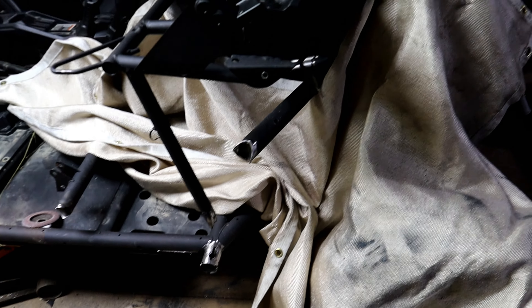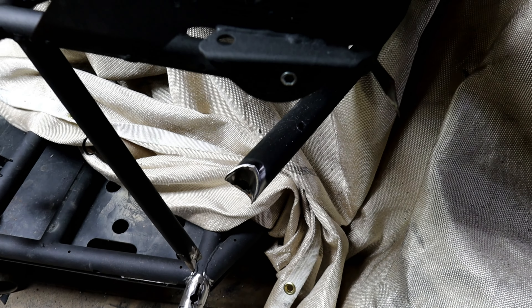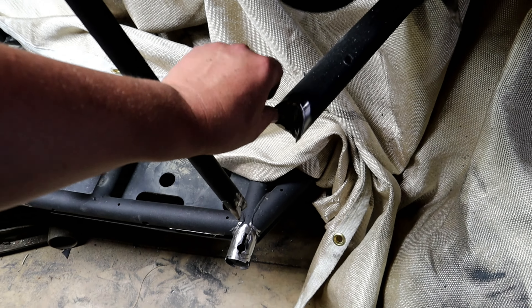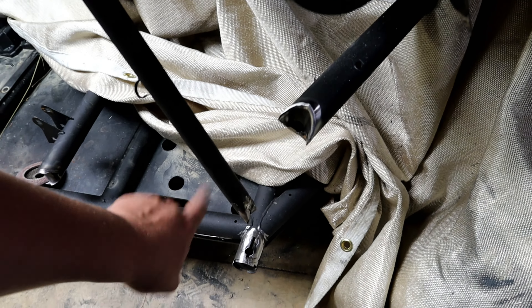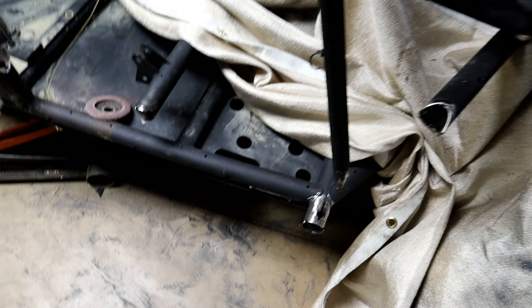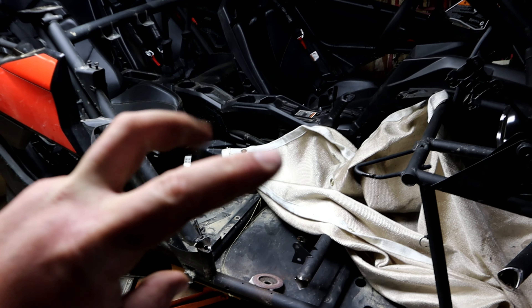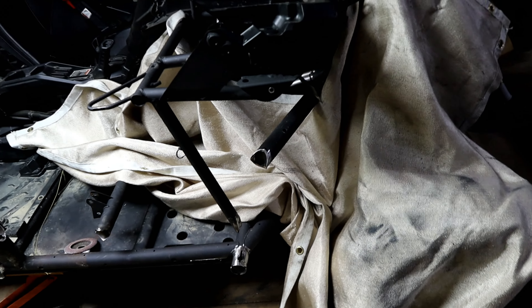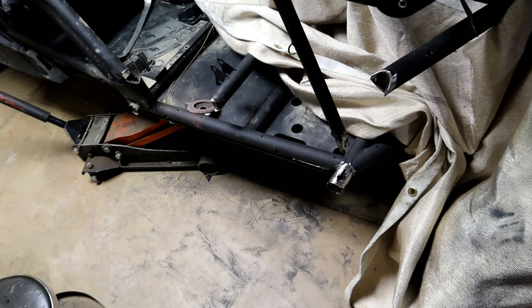As you can see, we got that bar out. We got everything cleaned up and are pretty much ready to throw the new bar in. We even got it all cleaned up in there, everything looking good. So because we're going from inch and seven-eighths to inch and three-quarter, we're leaving ourselves the inside diameter of the tube that was already in here and we'll just burn it all together — it will be fine. It's temporary. Down here we have to take that all the way out because we have the right tube for this one. Both of these tubes are oversized in the sidewall department, and inch and three-quarters is no slouch, so it'll be plenty fine.